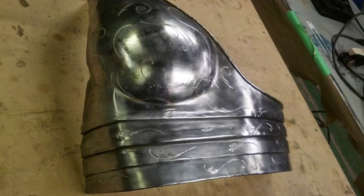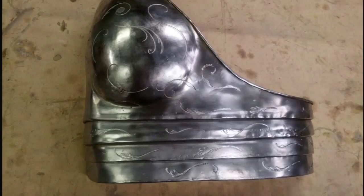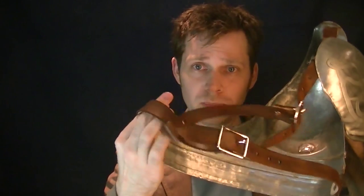I left it in there for about an hour, which created a lovely bucket of sludge — it's kind of gross. But once removed from the ugly bucket of sludge, rinsed off, and with the masking pulled away, it left a lovely roughly half-millimeter — or one thirty-second of an inch — etching across the entire plate where the filigree was exposed.